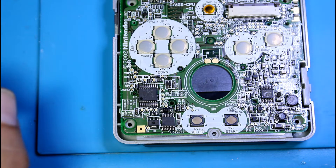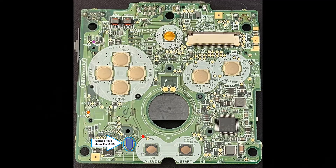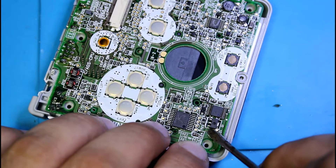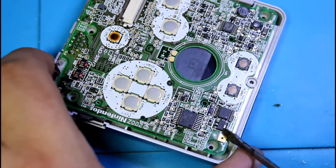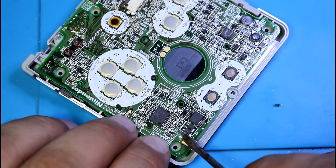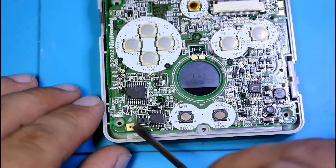It's not really hard to do — you can just use a utility knife or even a flathead screwdriver. I'll use this area here to showcase how it's done. That's all you really need is just a little bit of the copper showing. You can add solder to that and then solder the wire. This is just bare copper, so if you have flux be sure to use that. It makes the job much easier when soldering to exposed copper like this on a big ground plane.